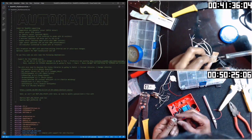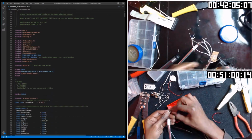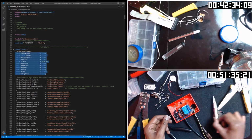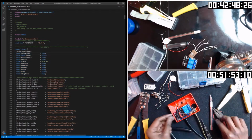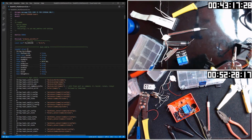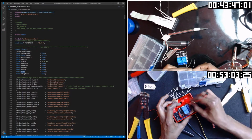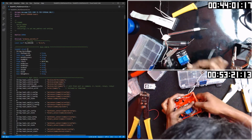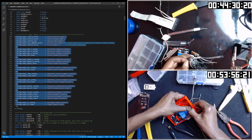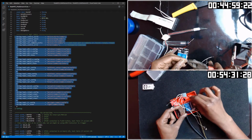A quick look through the actual code running on NodeMCU is pretty simple. I have a setup to set which parts of the sensor to use. So if you decide to use the non-soldered version, you just set use power LED, use relays, use LDR, and use IR to false. I have written it to broadcast values using MQTT with auto discovery. I have a previous video showing how MQTT works with HomeAssistant, and I have linked it in the description below.